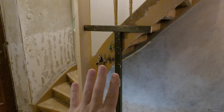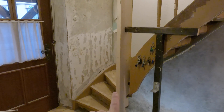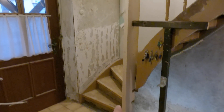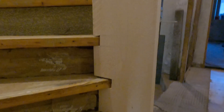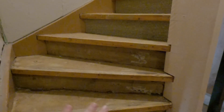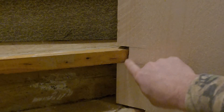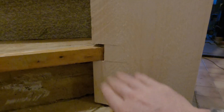I have the temporary T here — it's not supporting those last three or four steps. So when this post is removed, those three or four steps are pretty hazardous. Right now, I have roughly fit the new stair post into the stair treads. I'm just going to do some fine tuning to get it to fit a little bit tighter. We are going to be doing new stair treads basically just over the top of these, so everything you see will be hidden by new material. The gaps here aren't super critical.